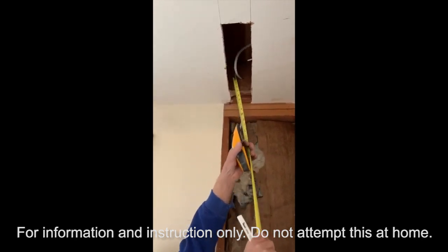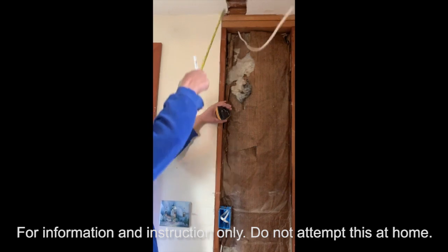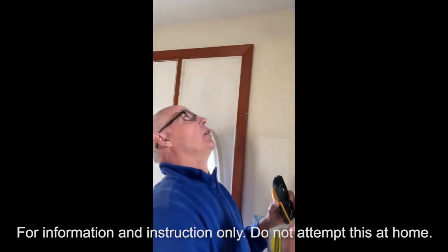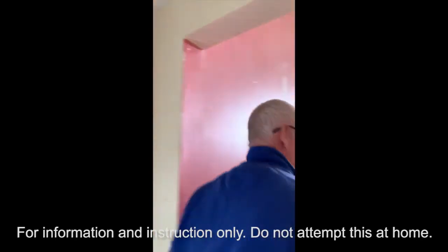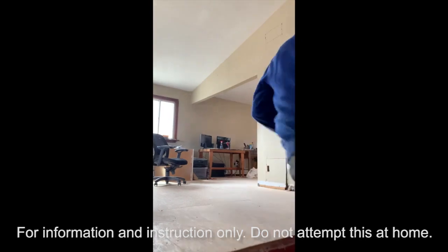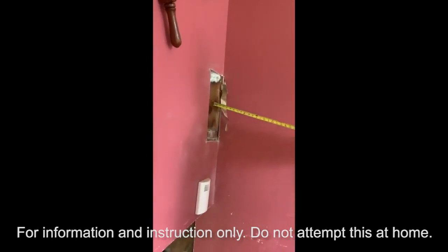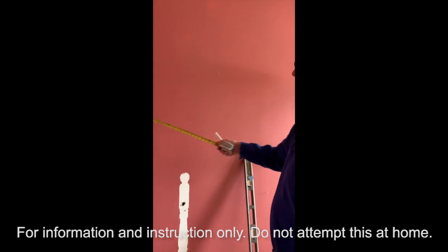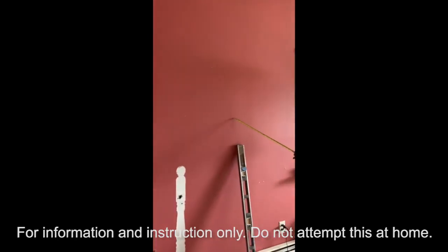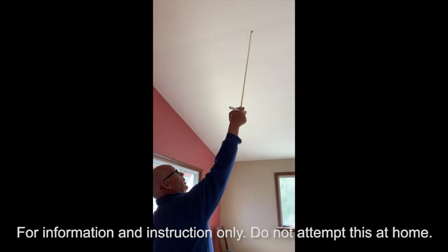This is a fish wire so you can attach two wires together. Once I add the wire I'll show you in the next video how to tape two wires together and pull the whole wire across. You have to map out where the wire has to go because you don't have x-ray vision — sometimes you run into obstacles. We're going to cross the ceiling, I've already drawn pencil lines and drilled through the plate of the wall. I have to cut channels in the sheetrock so I can drill between the studs to get enough space for the drill.